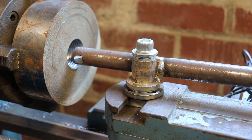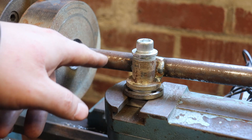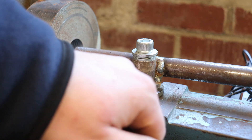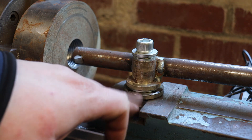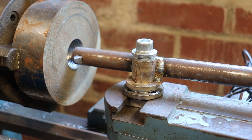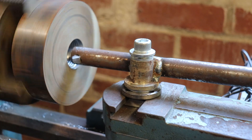So Operation Bodger Holder is on the second iteration now, and this seems to be working. It is literally a bit of bar with some high speed steel ground and grub-screwed into it, welded to a bush thing that I had, with a grinder nut as a spacer. Total Heath Robinson going on here. I'll put a cut on — it's working well. The other one had far too much flex. I'm just taking 0.2mm each side at the minute, and at the moment it's going well.